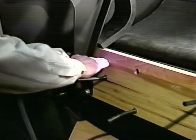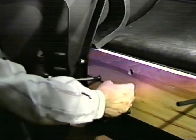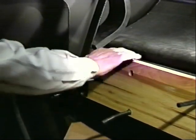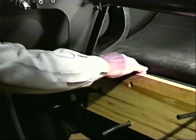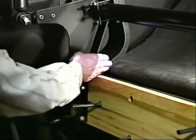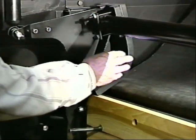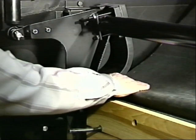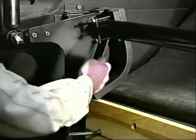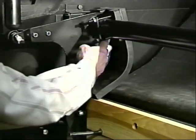We would inspect the hardwood plank for any horizontal cracks coming down through the plank, or possibly any vertical cracks showing failure of the plank. We'd also check the condition of the sponge rubber, and we would be looking at the positioning of the protective pad. This particular pad is installed to protect the pin deflector curtain. Without the pad, pins will force this curtain up against the hanger leg, damaging the curtain. So this pad is positioned correctly.